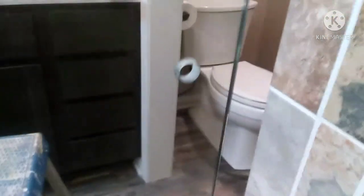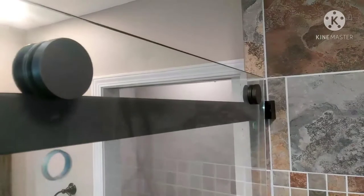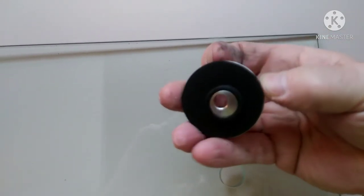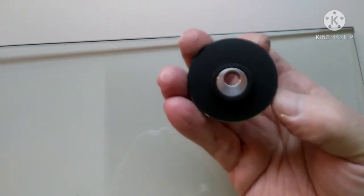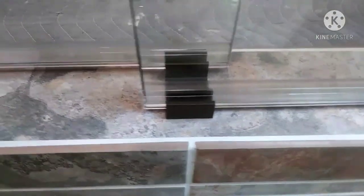Get your top wheels on. The inside panel goes on first, with wheels towards the outside and glass towards the inside. That panel only has one hole in it, on the side towards the shower head. It looks like it's drilled off-center but that's actually your height adjustment — it can freak you out when you're looking at it. Set them all the way up to start with. Then get both panels hung.